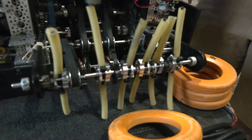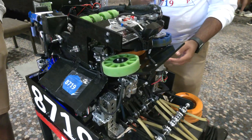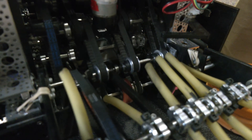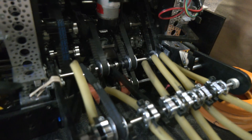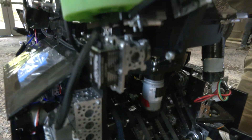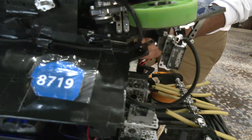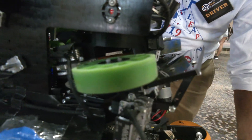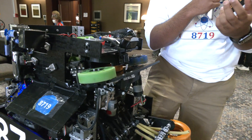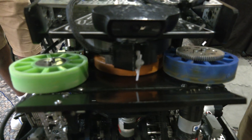Awesome, that's a great tip for rookie teams that are watching this. So you get it into your intake — how does it get up into your robot? So we have a belt system here with about 10 total axles. We got the bottom rollers, which we just cut up a compliant wheel and gorilla glued it on. From there it goes through our transfer, which is kind of a loop, and then we have our flap at the top to bring our intake down. The cool part is not only can we intake in the forward motion with our turret, but it can also turn while intaking, because the circle is actually in the center of the axle for the turret. So the bucket and the top half of the circle don't ever rotate — it's in the same position relative to the intake the entire time.